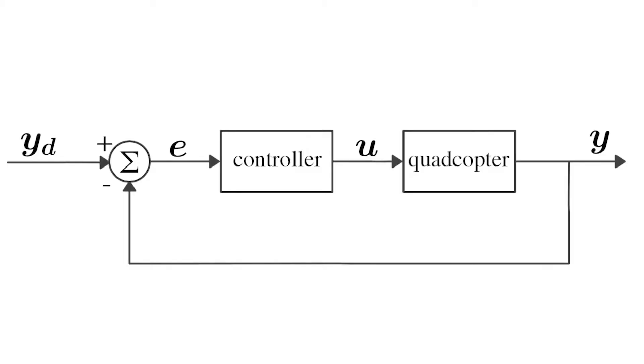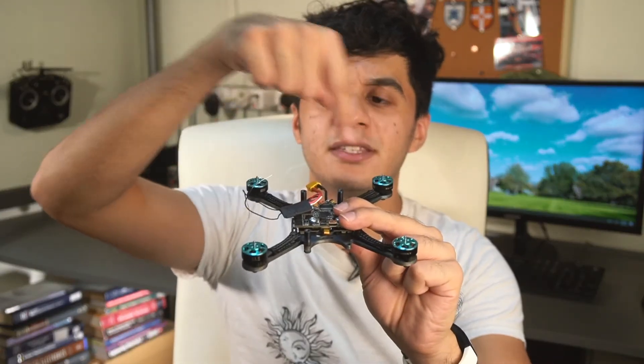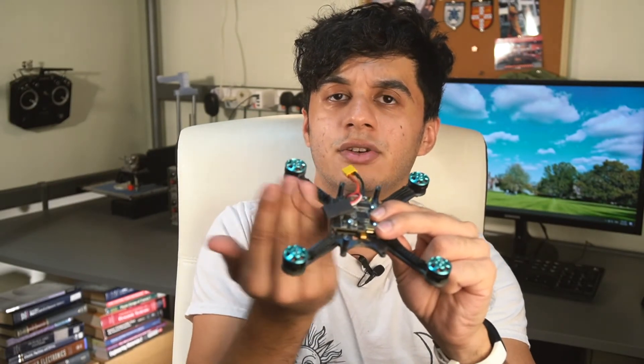So how do we actually know how fast to spin the motors? If you remember the diagram from the previous video, the controller generates a set of required inputs to our system and those inputs are angular accelerations. So how do we translate these angular accelerations into required motor speeds? From the video before that we worked out how to get the torques from those angular accelerations — so we know how to work out our pitch, roll, and yaw torques required. At the end of the day, these motors all produce thrust because we put a propeller on them, so the torque about the pitch axis is the thrust of two motors minus the thrust of the other two motors, times the perpendicular distance from those motors to the center of gravity.